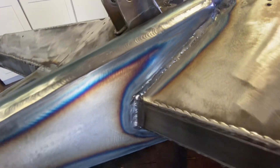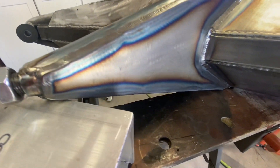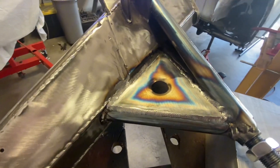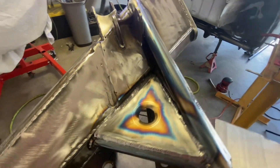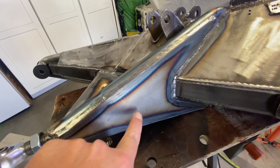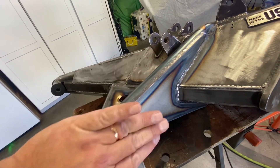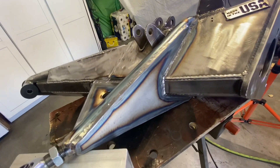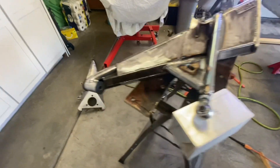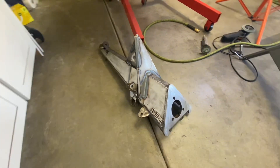The TIG welds came out okay — I am no expert, but they're gonna hold. I wanted to make sure I TIG welded it because these plates are 4130 chromoly. So it is plated on this inside support and the full outside. I had to clamp some things down and hit it with a hammer because this center tube is inch and a quarter and these outside two are one inch, so the plate actually had to bend over that. But it came out really good, I'm really happy with it. I think this is gonna be super strong. The second arm is almost done — I'm letting it cool off and I'm gonna do a couple more welds on it. Then these two are done.